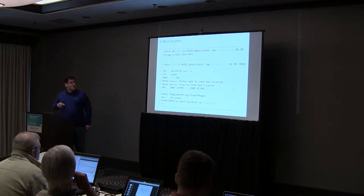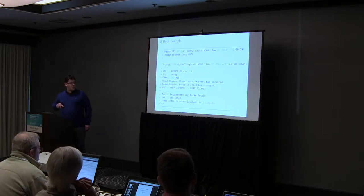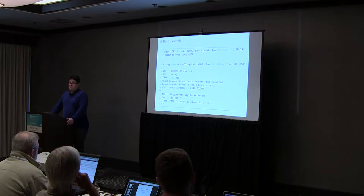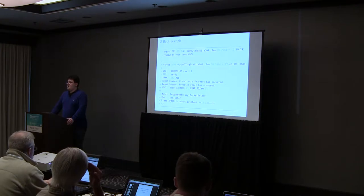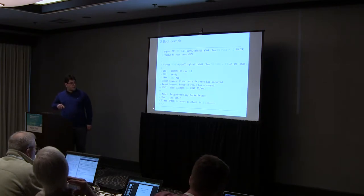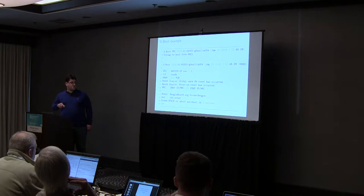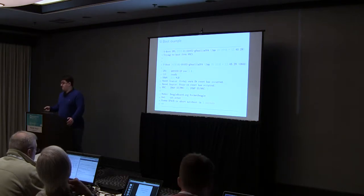What else do we see in the U-Boot boot log? We see we have quite a lot of DRAM, and ultimately we reach the U-Boot autoboot countdown. On this Pocket Beagle board you have to interrupt it with space, but that's usually not the case — usually it's any key, but this is specifically tweaked. If you interrupt the boot countdown, you will reach the U-Boot shell, at which point you can fiddle with the hardware whichever way you want.